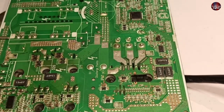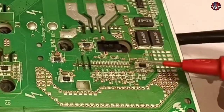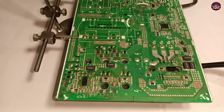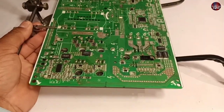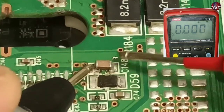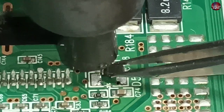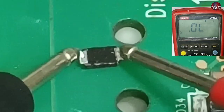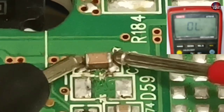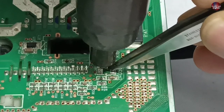Off camera, I removed this capacitor, this IC, and several other capacitors from this motherboard but the fault was not found. After quite a bit of checking, I identified the problem near the IPM. The diode shows zero voltage drop on diode mode and the capacitor beeps on continuity mode. I am now desoldering this diode. After removing it from the motherboard, it still shows zero voltage drop. Now checking the capacitor — it is not making any beep. I am now installing a new diode.